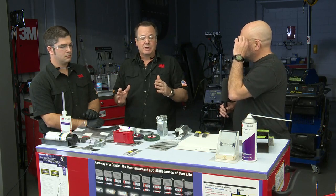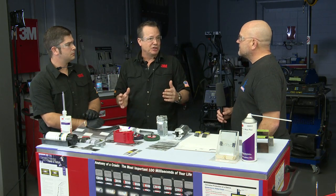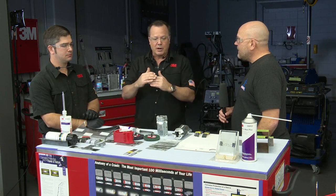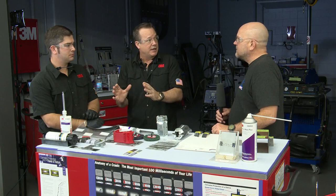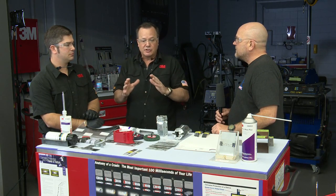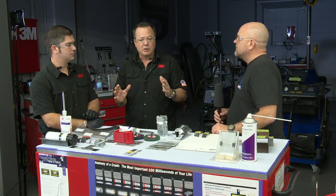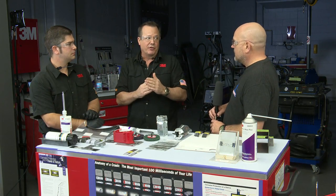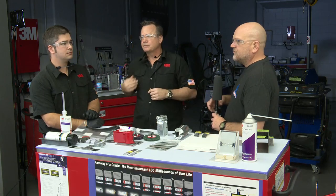Yeah. Okay, so we have to be very, very careful about that because typically, unless you're a chemical engineer, it's pretty hard to tell whether an adhesive is exactly equivalent. I just did a presentation where I showed an OEM spec sheet for structural adhesive, and it was 97 pages long of tests and qualifications to spec that in. So you could imagine something that's just slightly different may react completely differently in a collision. So when they recommend an equivalent, I'd be careful about it. If they're calling something out, just use that.